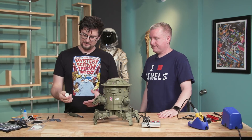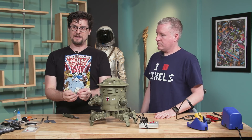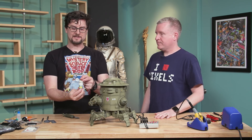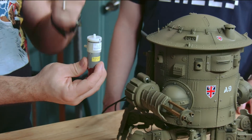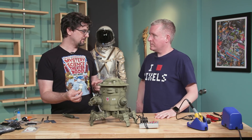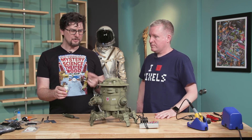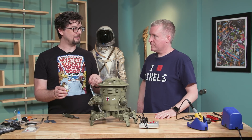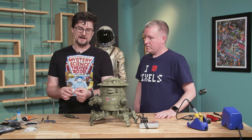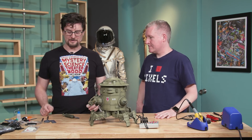Let's talk about the parts for the smoke pump. When I was researching it for the ghost trap, typically the setup was you had an air pump that was just blowing out. You'd get one of the beefy e-cigarettes that you press a button to heat up. So when you vape, you push the button, it heats up, you inhale — that required delicate wiring and soldering directly on the e-cigarette, and basically you're blowing through the e-cigarette backwards to make it smoke.